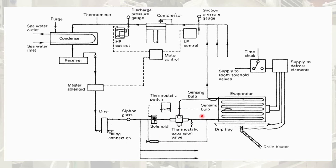In the thermostatic expansion valve, there will be a pressure drop. Due to the pressure drop, the liquid refrigerant entering the thermostatic expansion valve converts into a mixture of liquid plus vapor refrigerant at the outlet of the valve, and this is sent to the evaporator. In the evaporator, the liquid refrigerant flows in the tubes, which is a series of finned tubes. The heat is extracted from the evaporator room, changing the refrigerant phase from a mixture of liquid plus gaseous to a completely gaseous state.